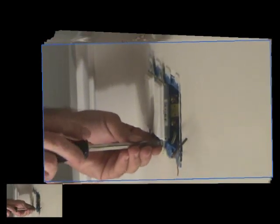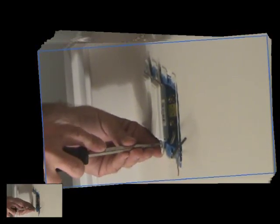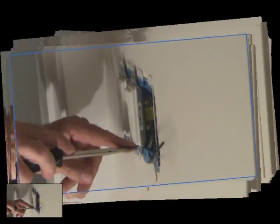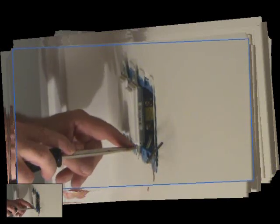If you use a power screwdriver or drill, that kind of thing, you have a tendency to not be perfectly careful. It's very easy to ram the screw in there and find out you still need to rearrange the wires back in there. Or even if you've got everything right, if you tighten it up too much, it's very simple to strip out the plastic threads from your metal screws. So I like to do all this by hand.